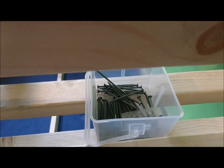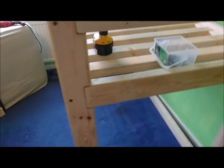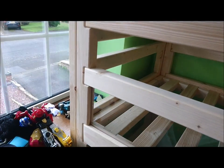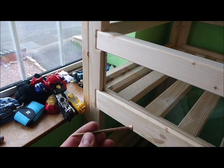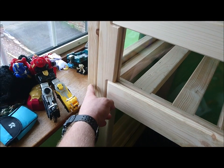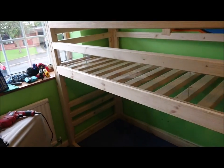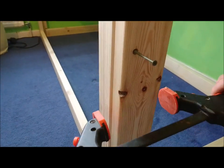I've used these 3-inch deck screws because I already had them, and a lot of what I do is about using recycled materials or things that I've already got, so I haven't had to pay for them at all. The one thing I did get was some 4-inch gold screws from Screwfix — they're 4 inches so that they fit through the end frame post and into the cross rail. As I said, with the twist on the post when I put the pocket screws in, that'll just pull it all in nicely.